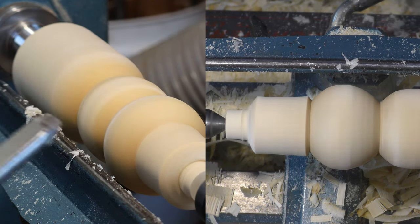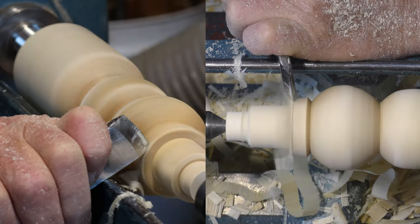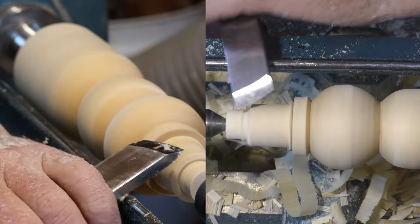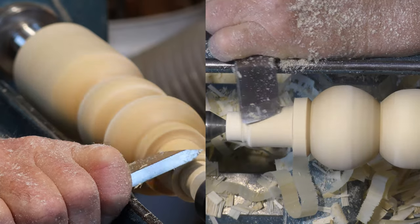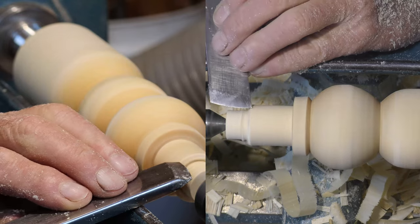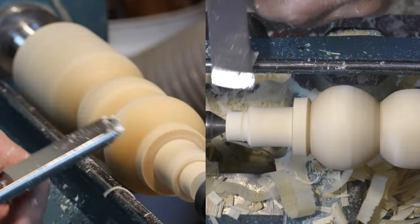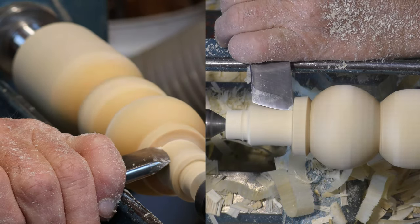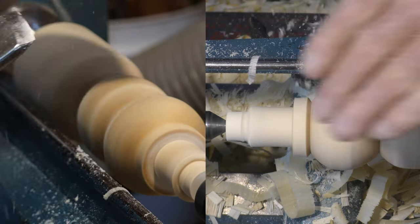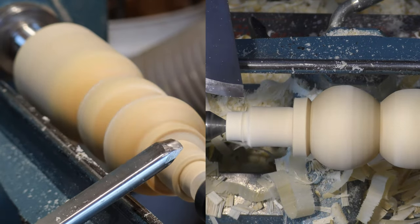If I want to cut a little shoulder and have that cut cleanly, I can use it like a steep one side of a V-groove to clean the end grain up — come across the shoulder here, use the short corner and come in, which gives a nice clean surface. I also tend to use the long point up with a kind of peeling cut, and that gets the nose of the tool under the grain but leaves a very nice clean surface. This doesn't work so well on wet wood, but on dry wood you get a wonderful thin shaving coming off. I can then use the bevel side and roll the tool into the cut — you'll see that in some of the videos where I'm using dry wood.